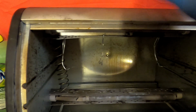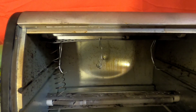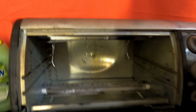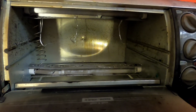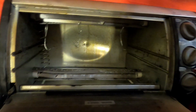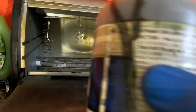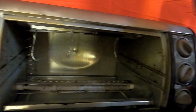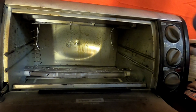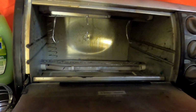So the important thing is I'm using this toaster oven, which is capable of 400 to over 450 degrees Fahrenheit. Depending on the colors that you're going to be powder coating, you have to take a look at it. This one says 450, and depending on the color, it determines the amount of time you're going to have to leave it in the oven, and in some cases the amount of time is spent with the parts in the oven or actually waiting after that. So yeah, that's all you need.